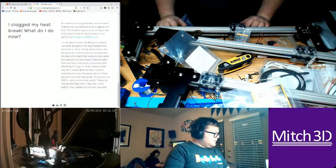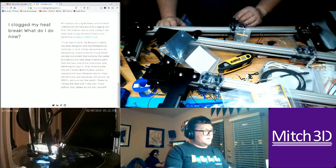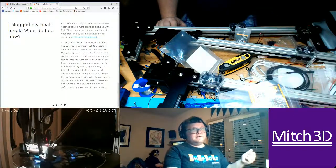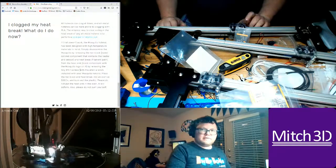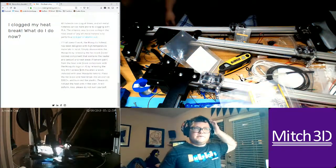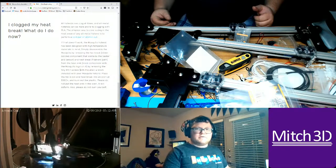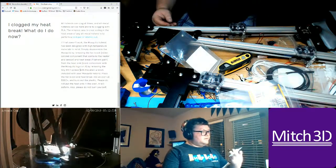I'm either going to do 3 batteries at a time, just because of the increased power draw from the cartridge. One battery can handle the current draw, so that's not an issue. I still think it's going to draw about 60 watts continuous, which is about 6 or 7 amps. So a 5,000 milliamp hour battery, times 3, that's about 3 or 4 hours. I'm also stepping down the voltage to 12 volts from 14 whatever volts.